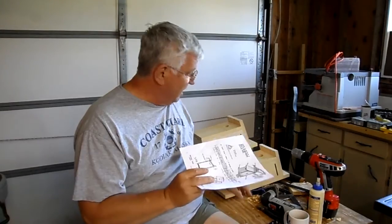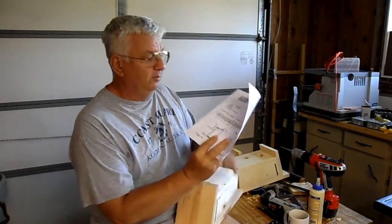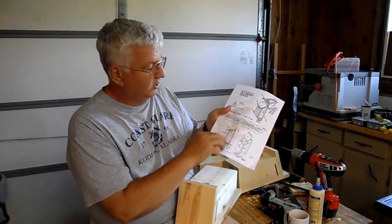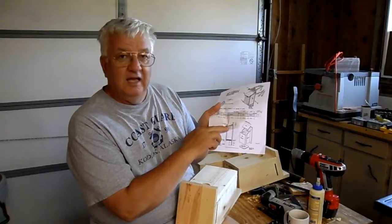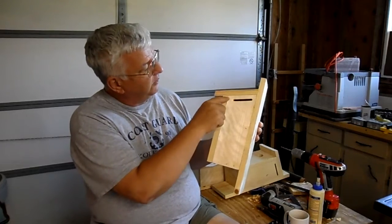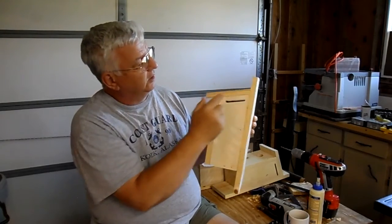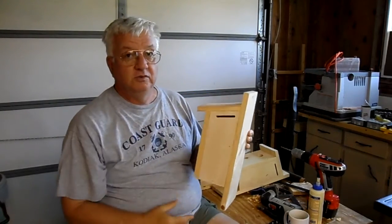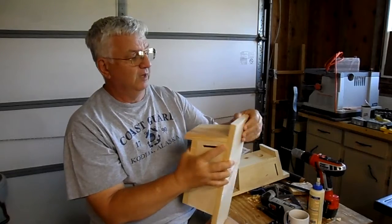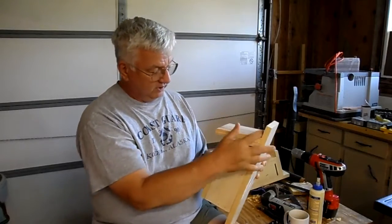Let me go over some modifications I made, mainly because I'm able to cut angles. On this bluebird box, when the roof comes down they don't angle the front face, so it naturally makes an air vent. On my bluebird box I went ahead and extended the angle to the front and even put an angle in the back. So I did away with the top bar that's supposed to shed rain, because I glued it and nailed it across the back with my pneumatic nailer. When I paint these white, that'll be enough to seal it off.